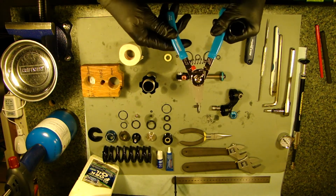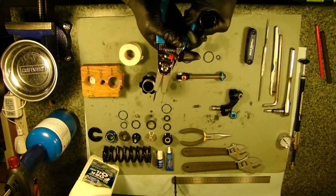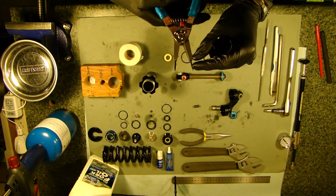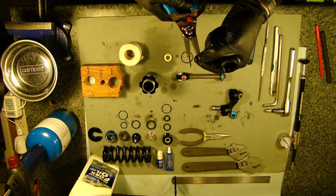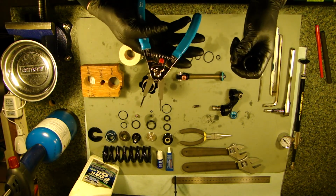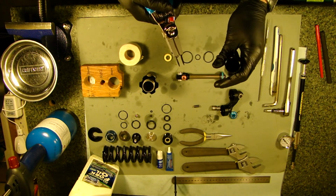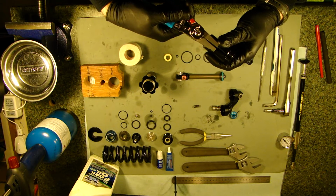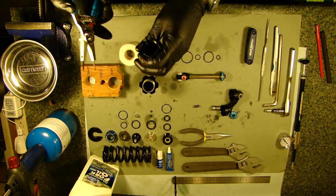This one is an adjustable one, so you can do external snap rings or internal snap rings. And it has an adjustable length. You can put in different tips for different types of snap rings, and you can adjust the depth. So it really helps for reaching all the way in, because you have to reach about this far into the boost chamber in order to get the snap ring out.